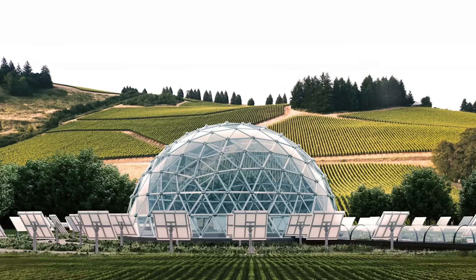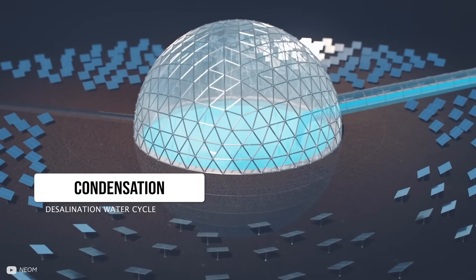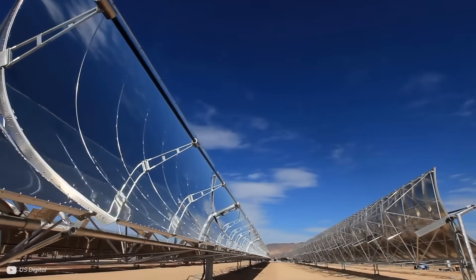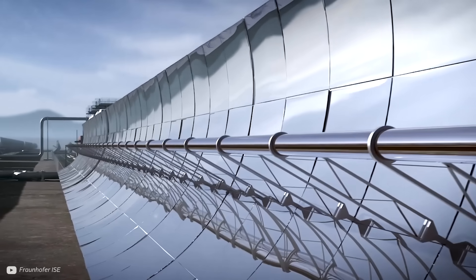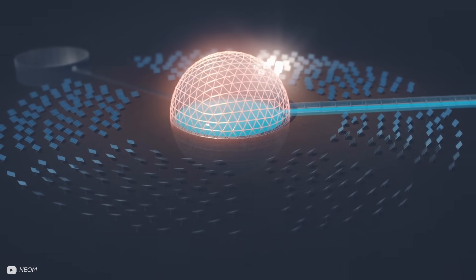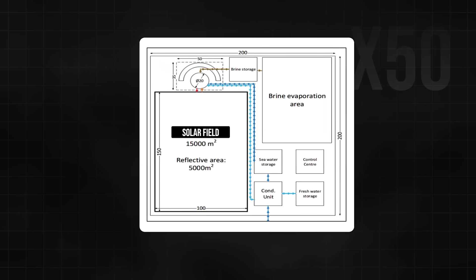However, it leaves me wondering whether a dome design is the best way to do this. One of the main benefits of the dome seemed to be its simplicity and large condensation surface, but similarly to the original design, none of the water condensed onto the dome walls is collected, and the whole thing is becoming quite complex. Unlike the original design, most of the heat for the second design actually comes from a nearby concentrated parabolic trough solar field. These mirrors heat oil flowing through a pipe, and that heat is then used to evaporate the salt water in the dome — meaning all of the heat is coming from an external source. Plans show that this solar field would take up an area about 50 times bigger than the actual dome.